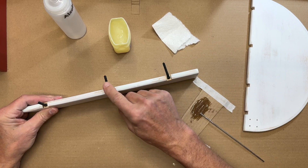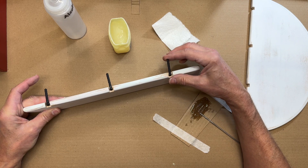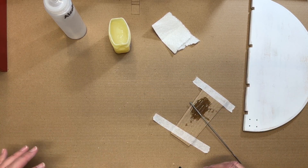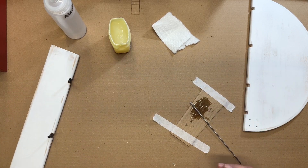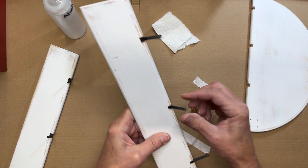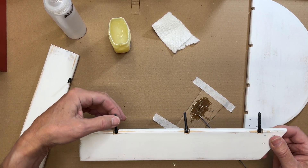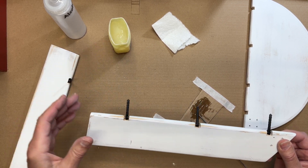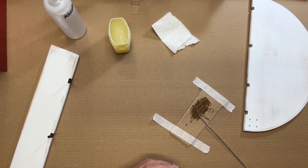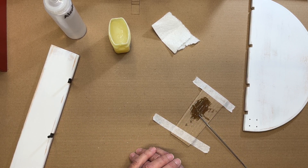So now we're going to install - that's the outboard portion, so that's where I'm going to have the head. Positioning that in there, and they're going exactly all in the same spot. Now you see that angle there - it's very important - we're going to turn that properly. So we're going to let that basically cure. Once that's cured, like this side is already done, these are in here and they're not going to pull out. So this one is now ready - coating this with epoxy, putting some in the actual hole of the horizontal stab, and then installing it.